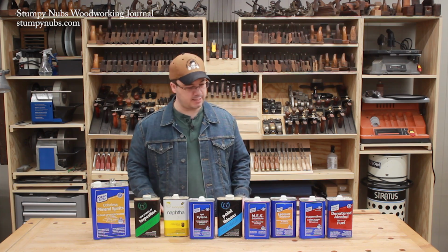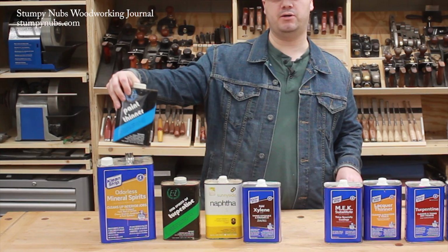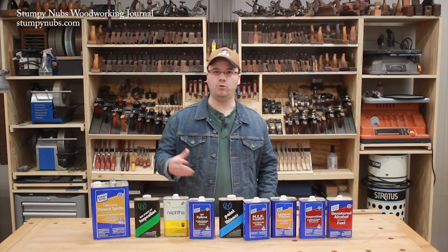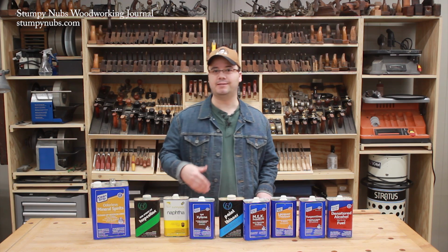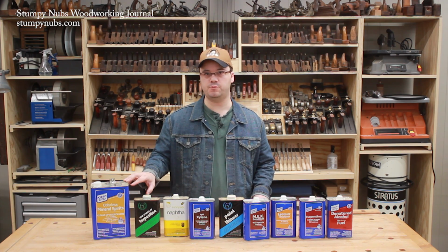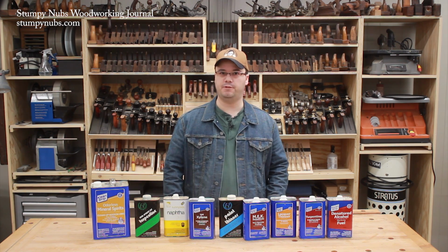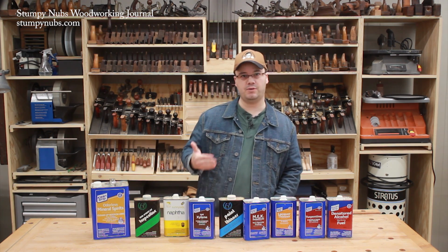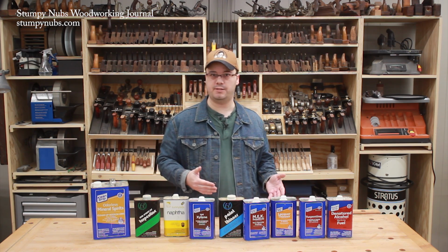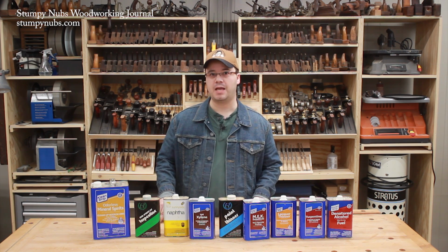By the way, if you see a can labeled paint thinner, it's just mineral spirits marketed for that specific purpose. There's no difference in the contents. Odorless mineral spirits are made by removing the components toluene and xylene. This leaves a better smelling mineral spirit that's still perfectly effective for thinning finishes, but slightly weakened as a solvent. On their own, toluene and xylene that was removed from the mineral spirits are powerful degreasers that evaporate quickly, making them useful for cleaning in industrial settings.